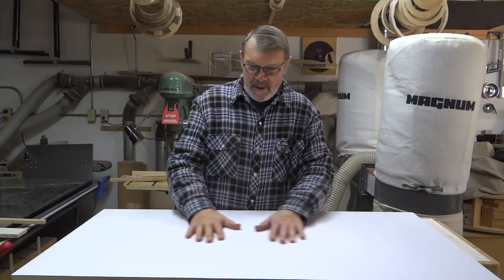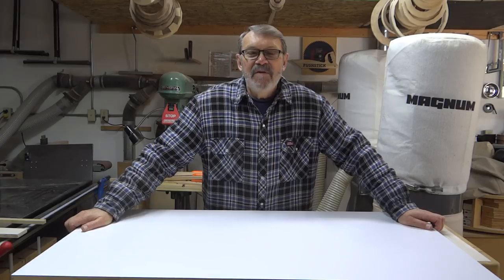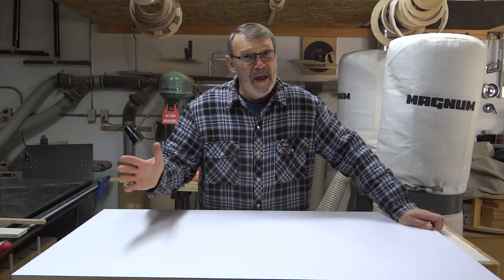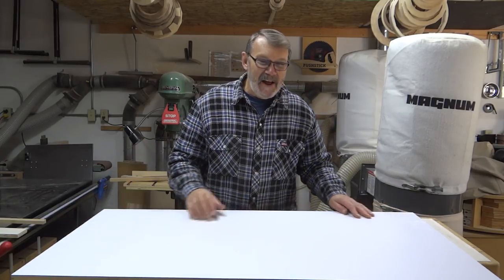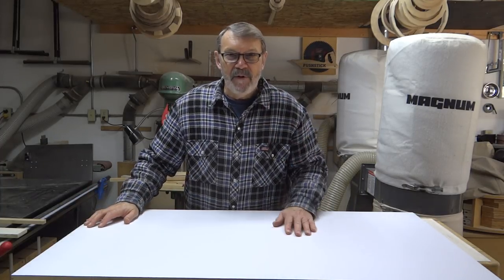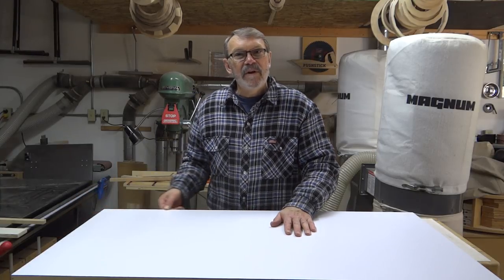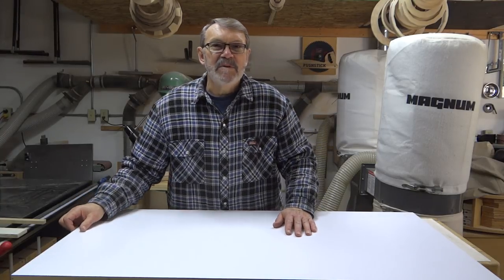Okay, I'm happy, looking good just like new, and I hope we'll get another 10 or 15 years out of this one, if I last that long. Now, the problem with the contact cement, after I thought about it, you probably already realized, is that using the J roller squeezed it out so it was underneath the Formica and was causing me a problem.